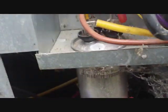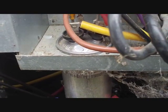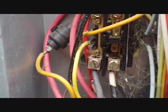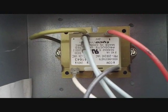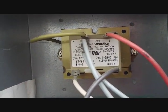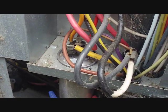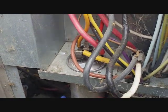We can see down here the capacitor is blown, and physically you can actually see the bulges on top of it. Everything else looks a little weathered, a little bit of smut on the contacts here. There's our furnace control board. It's a 240, 24-volt transformer. We're going to take that out and replace it and see if that does the trick. Otherwise it could be like the other day where we have a fan motor destroying a capacitor, but we'll see.